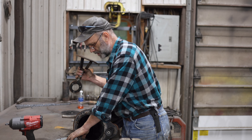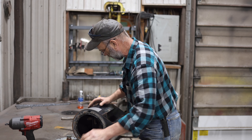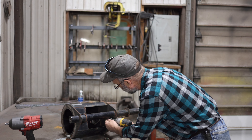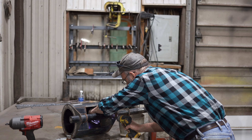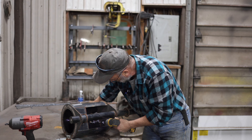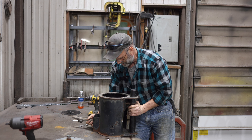Okay, I got that out. Make sure when you take it apart that this is still tight — I've had a few that were loose. This is a jam nut. This assembly is set up so you can adjust this piston up and down a little bit. When they machine these things, they have that in there in case you change crankshafts and it changes the throw a little bit. You can adjust this up or down because it has to come up as far as it can without actually coming in contact with the lid. If it goes up too far and hits that, it'll cause binding and eventually crack or saw out the diaphragm altogether. And if it's too low, you're not going to get the compression you need. So set this aside, then there's one more plate in behind there you want to get out and loosen up — take the bolts out.